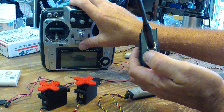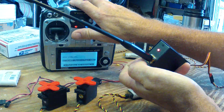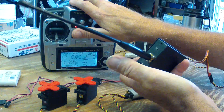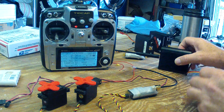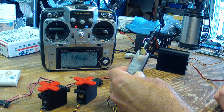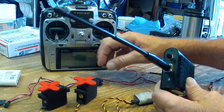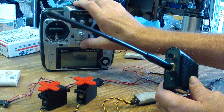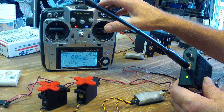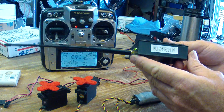I'll need to bind it, so I'll set this one aside and go into bind mode. Power on — it's in micro mode, then bind mode with a flashing green. Now it should bind. Turn the receiver on, let it bind, then turn everything off and back on. Good PPM, receiver on, and it's connected.